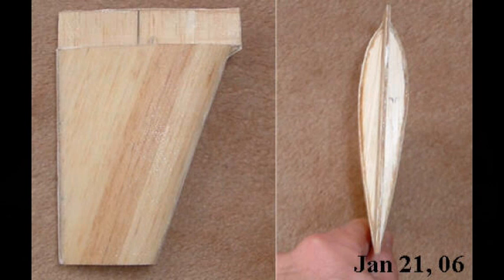To build the fin I made a center plate, which is a sheet of 1/16 inch balsa wood that has the shape of the keel and also has a stub sticking out the top for attaching it to the hull. I took that piece of balsa wood and laminated it with two layers of 6-ounce fiberglass cloth on each side, all set in epoxy.